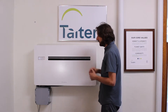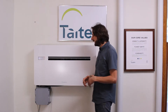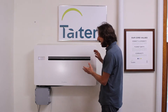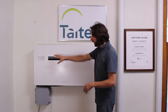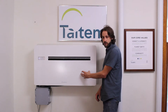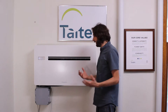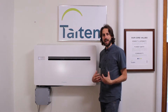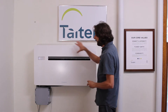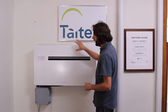We had basically no issues at all. People were really satisfied with the amount of heat it was putting out during the heating season and also how quiet it actually is. It's operating right now in air conditioning mode, so the compressor is running right behind here and you can't hear it. Even though the compressor is inside the building, we can't hear it running, which is really great. You do have a little bit of fan noise, but you would get that with any unit on the indoor coil.